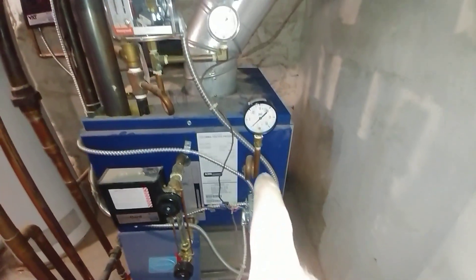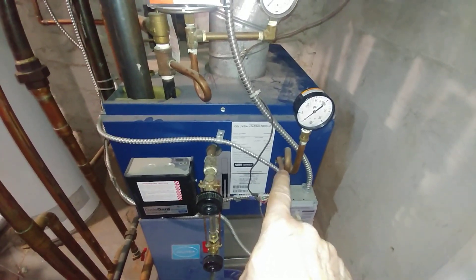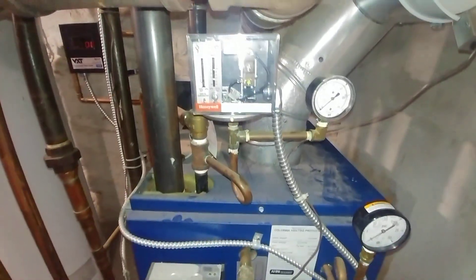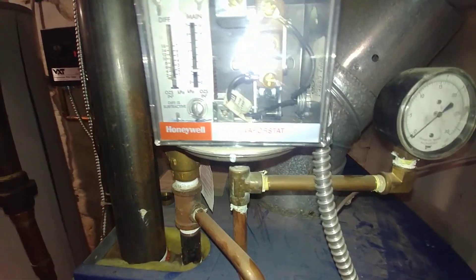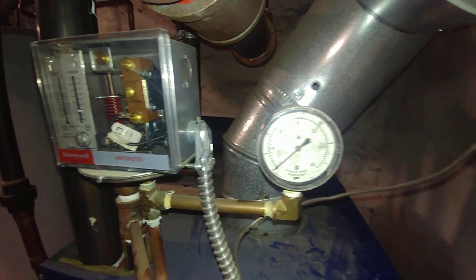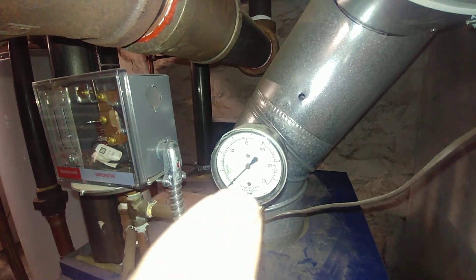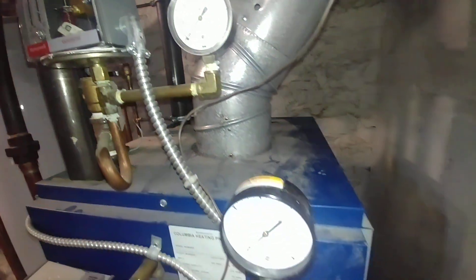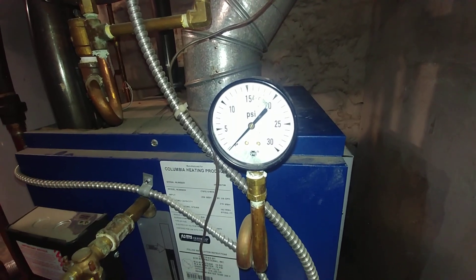Service switch. Normally the pressure control is mounted here, but we've moved the pressure control here and it's actually a vaporstat — the non-mercury type. There is the low pressure gauge on there. It reads 30, but that is 30 inches of water column. And that is the 30-pound gauge that's required by code.